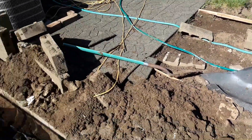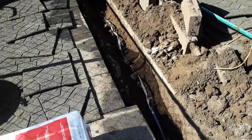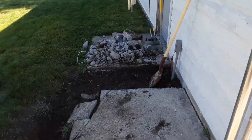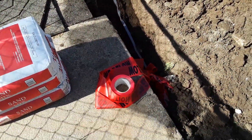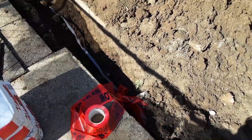This is kind of the before — I buried the last bit of cable. There's a little bit of dirt on top of it, a little bit of extra concrete so people don't dig into it in the future. Then a whole bunch of red caution tape for electrical goes on top of that, and then we bury the rest.